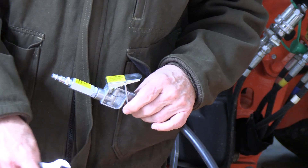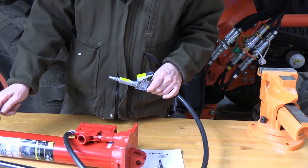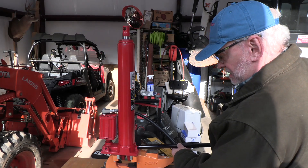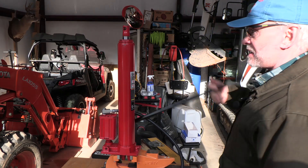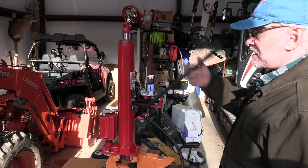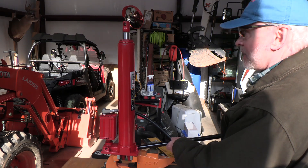This is the hydraulic air pump and everything is completely assembled. We'll have to bleed the oil in a minute to get it ready — that'll be our next step. I've tightened the bleed valve and we're going to cycle this up and down a few times. It's in a vise so it's vertically oriented. We'll cycle it up a little bit and then release it — it should come down.